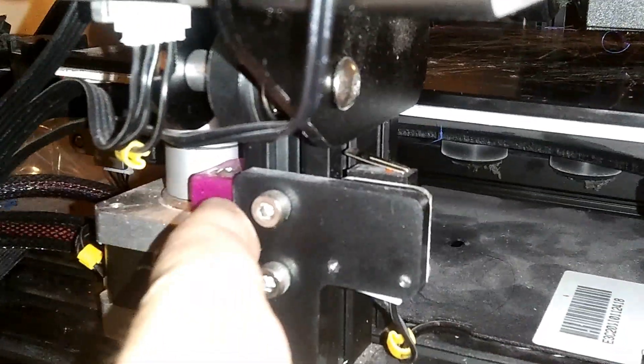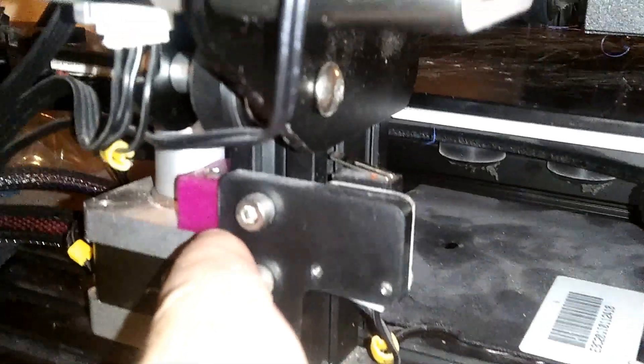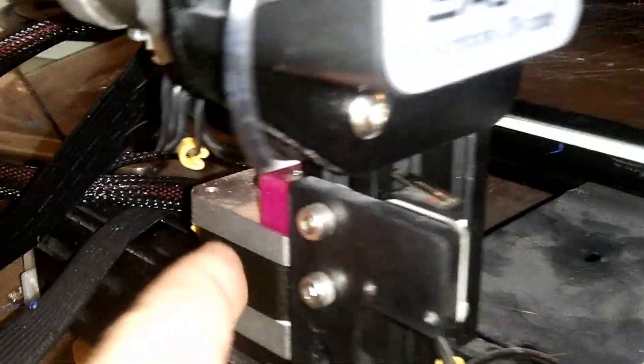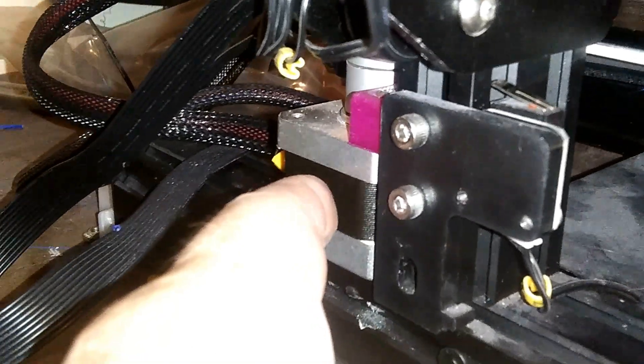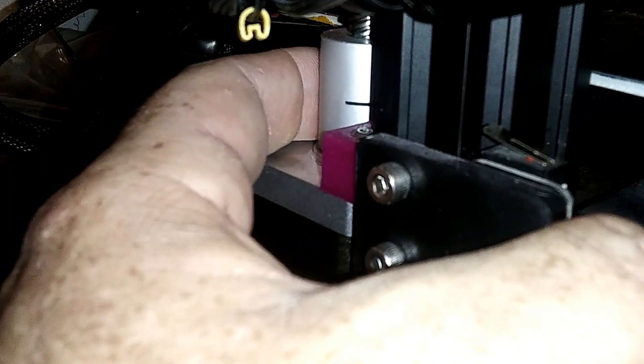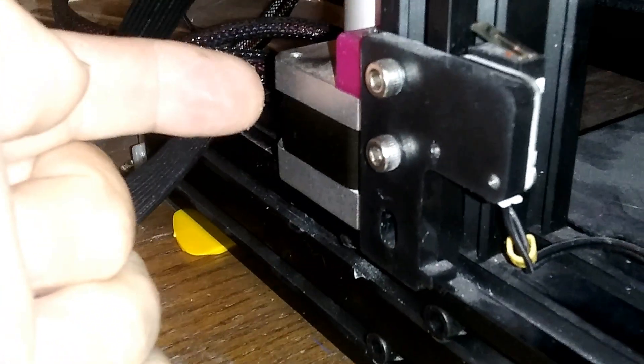When my Z motor had a problem, I immediately thought that was it. I put a different mount on first and it worked for a few cycles and a few prints, then stopped working and started making a really loud sound every time it would go — and it wasn't actually going up. Little did I know the motor wasn't burned out. Sometimes it would turn and go up and down, sometimes it wouldn't, and eventually it got to a point where it just buried plastic into a print over and over because it wouldn't go any higher.